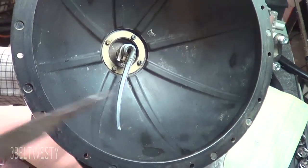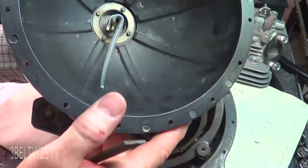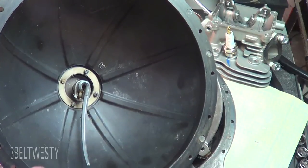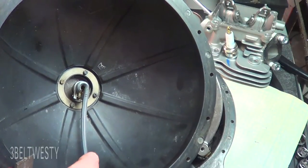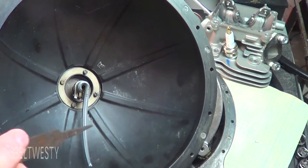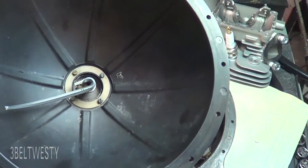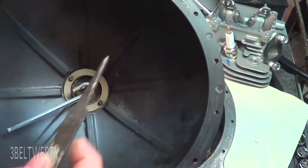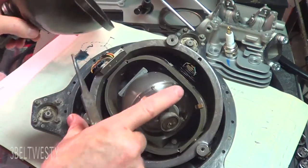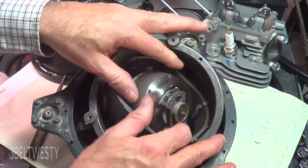And what that does is it actually locks the galvo down mechanically so it doesn't get screwed up in shipping or takeoff or landing, anything that's gonna hurt the thing. But anyways, this deal on here is turned manually. There's a knob and it'll spiral around, and it's a weird mechanism. It'll actually come out of the bowl and then touch this and lock it down. And so when it's unlocked, this is free to move.